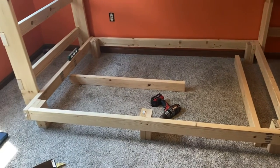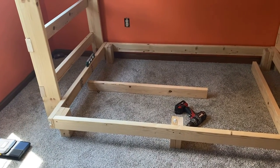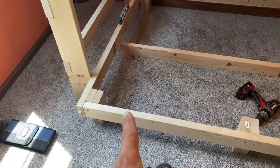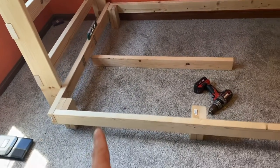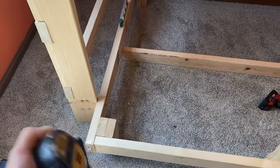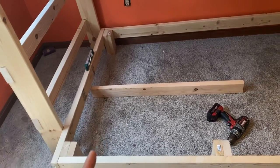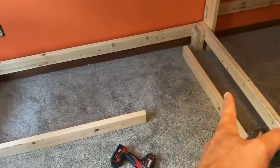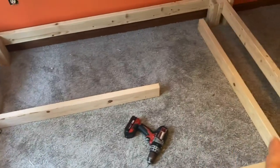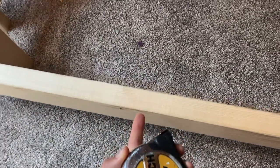Now we're checking if a twin mattress fits down below — it fits perfect. We're going to put some two-by-fours and make a little frame. Here's the frame for the full size mattress — we're not going with a box spring, so we'll do slats similar to above. A full is about 52 inches wide, so it's extended roughly six inches. We'll run one two-by-four through the center at 26 inches and then run 12 on each side screwed in from the back.